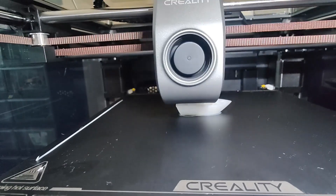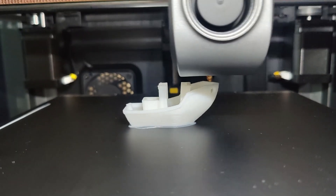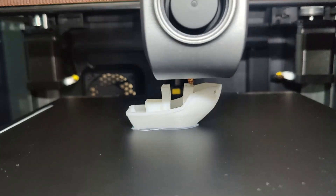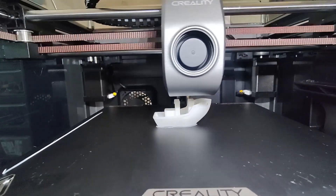The Benchy turned out pretty good coming off the Creality K1. I know white's not the easiest color to see, but I continued to print for the last week constantly and haven't had a problem with layer shift or lights flickering since — just proving that it is in fact the power supply setting, more importantly the 230 to 115 volts. I really hope this simple quick fix helped you out. If it did, leave a comment below. The channel is called Ham Radio Dude — thanks for watching and have a good day.